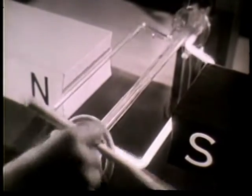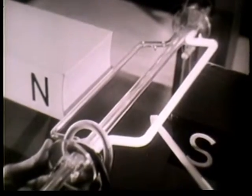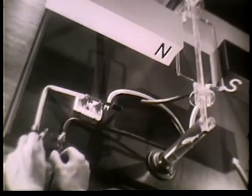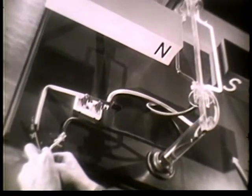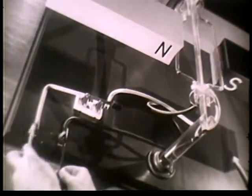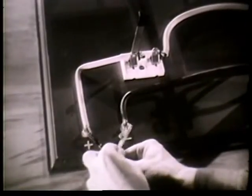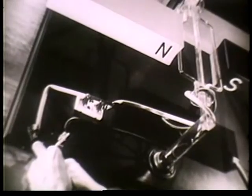Momentum carries the loop a little past the magnet's south pole and the direction of the current through the loop is changed. Notice the loop rotate another half turn. That's because its polarity has been changed. The side of the loop that was a north pole is now a south pole and vice versa. Here again, the repulsion and attraction is repeated. The power of this repulsion and attraction is doubled because it is taking place at both poles at the same time. Therefore, if it were possible to keep changing the direction of the current at precisely the right moment, the loop would rotate without halting.